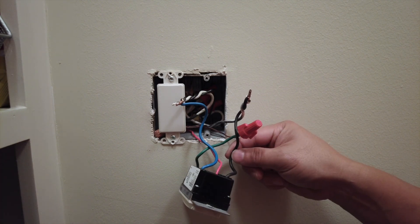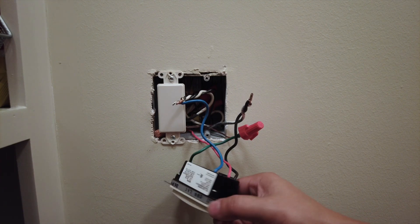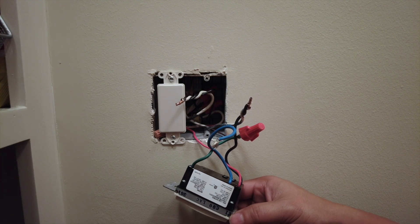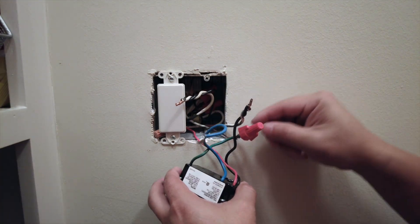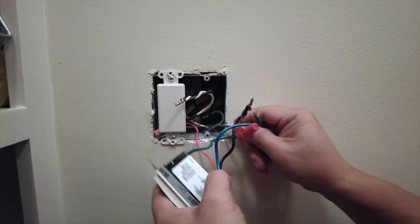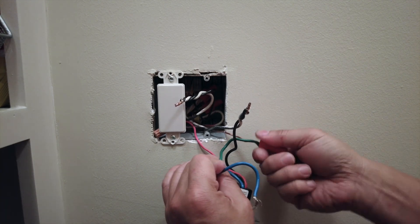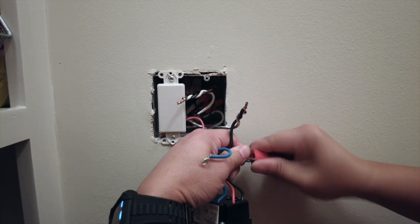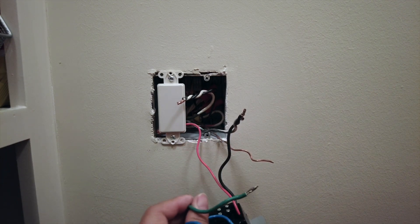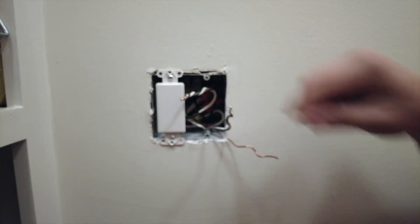They call it the load — basically it's what comes after the switch is on. It transfers the hot to the load so that the light will turn on, for example. What I'm missing here is the common or neutral, which is usually represented by a white wire. I realize I'm missing that, so I'm going to show you that I'll remove the dummy cover on the left side, because I know there's another cable hidden there. The existing switch does not use the neutral or common wire, so it's not connected — but most smart switches do require the white common wire, and you'll have to pull that out and connect it for the new smart switch.